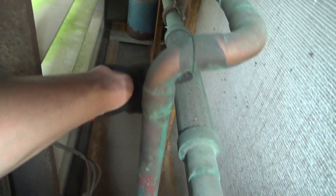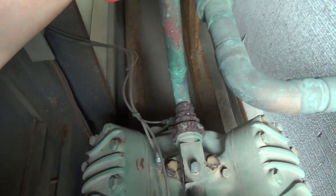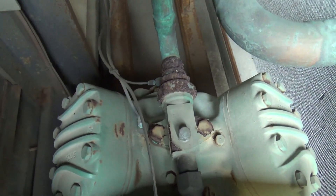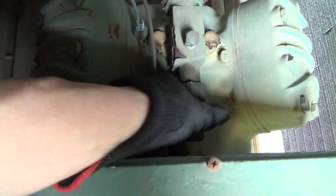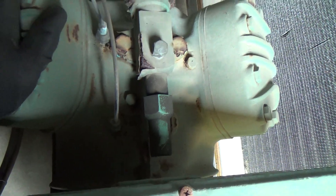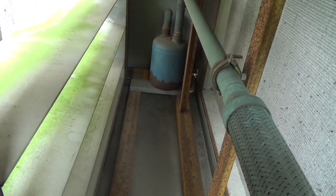Mind you, if it's leaked when it's off, it won't make a lot of oil. I've had these leak on the discharge pipe before, but this looks fine. Rotor lock style connector there — that looks a bit wet, but it's not really soppy wet. If it's leaked when it's been off, it won't leave an oil trace. There's an oil accumulator down there.